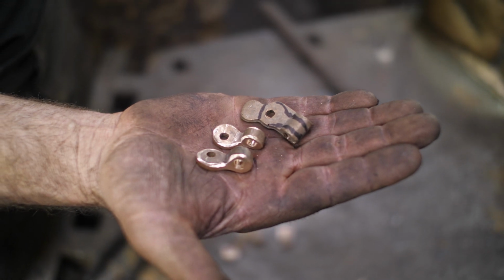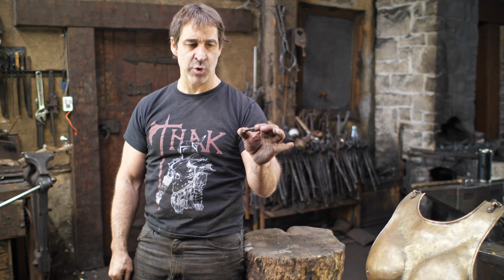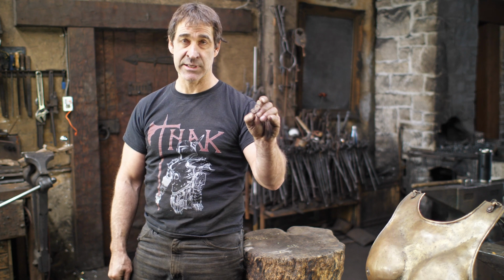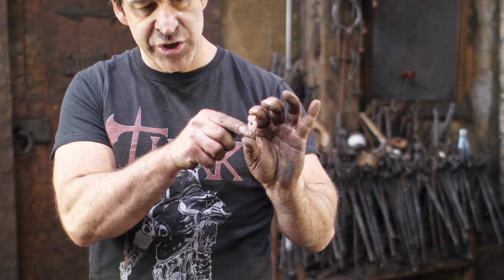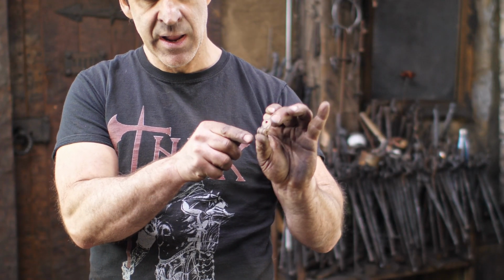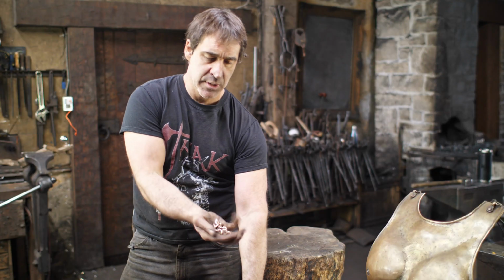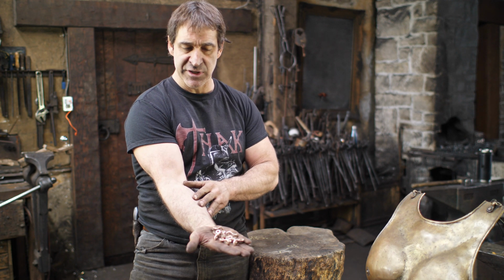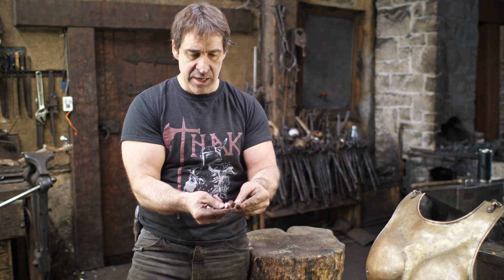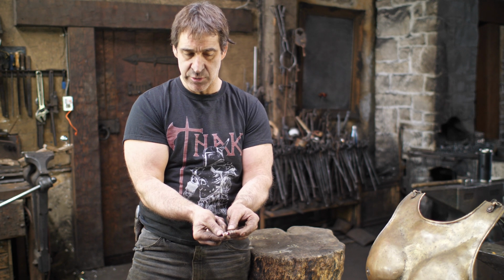Someone had given me a bunch of these little brass castings, and I believe they were actually for a toilet seat, the hinge for a toilet seat, oddly enough. And what I end up doing is, you can see where I've sharpied on there, is just cut it down and make it into this little tab for holding the ring. So I've already gone ahead and done it with most of them there, and this is what my end product becomes. We'll just now quick go to the bandsaw and I'll show you the process to do that.